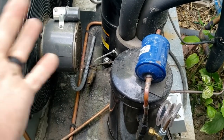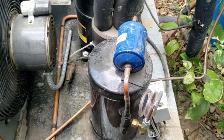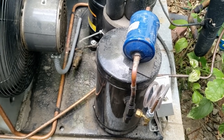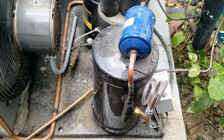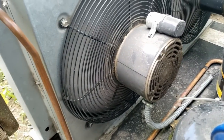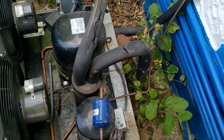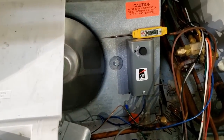I'm told it froze up, but they've already thawed it out. They're really doing a disservice to themselves by not giving you a good accurate description of what's going on. That's not our people's fault - it's the owner not getting the information to the service person. We've got our usual maintenance items: dirty coil, possibly low on charge - hard to tell yet as the cooler's not down to temperature and the TXV is probably adjusting. First thing I did was make sure all the fans were running.